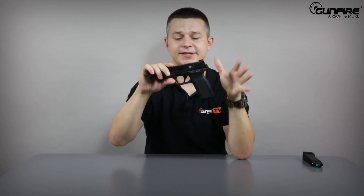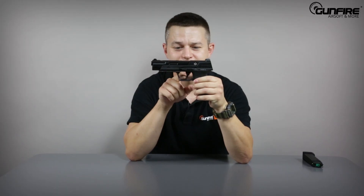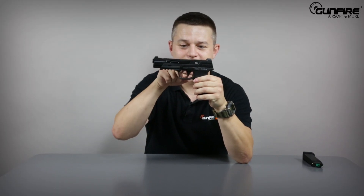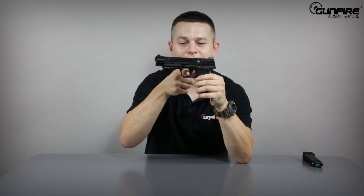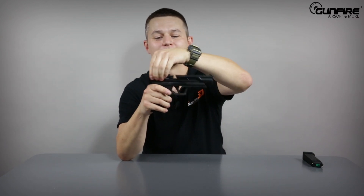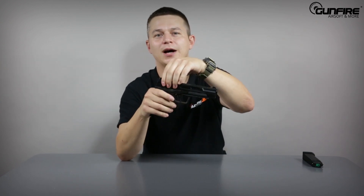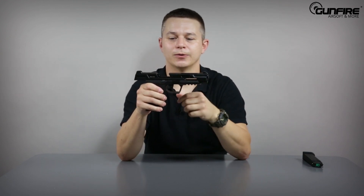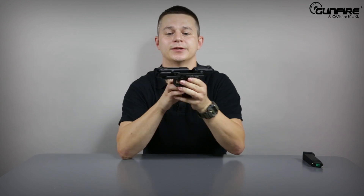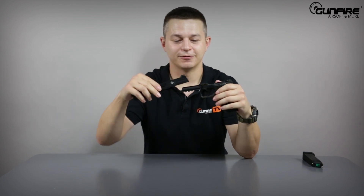The trigger has two safeties. The first is a push pin that blocks the trigger. The second is the construction of the trigger itself — it's made of two parts. If you press it only at the top, it won't fire; only when you press it properly will you get a shot. The slide is made of two parts, and only the back part — which is very light — moves. That means the pistol is very efficient and the action is very, very fast. To open it up, set the slide in the backward position and use the lever, which is also ambidextrous. The slide then goes forward and off. That's how easy it is to maintain the cleanliness and lubrication of this beautiful pistol.